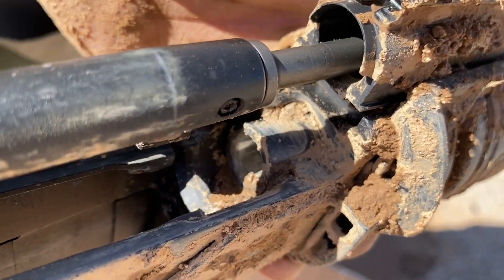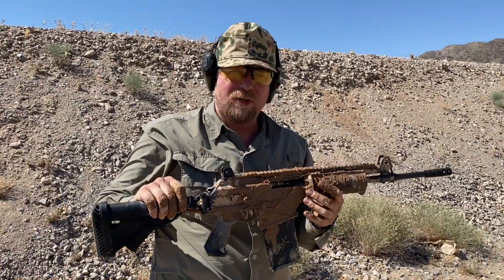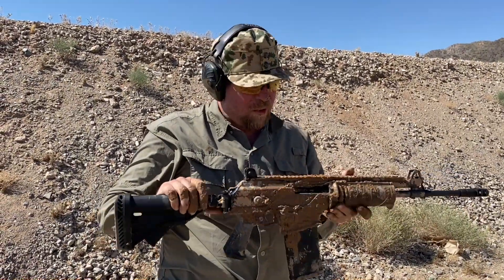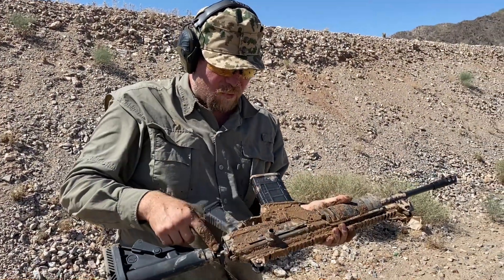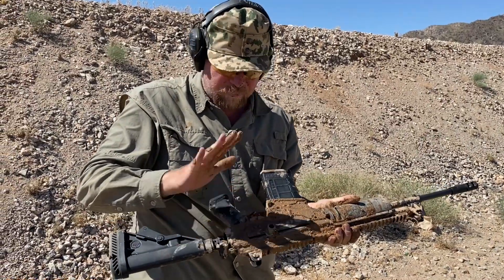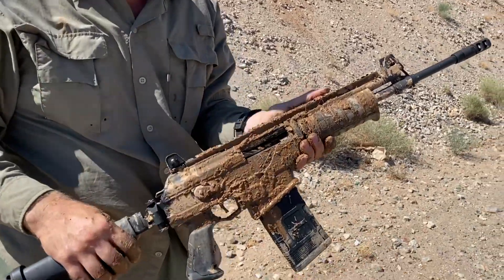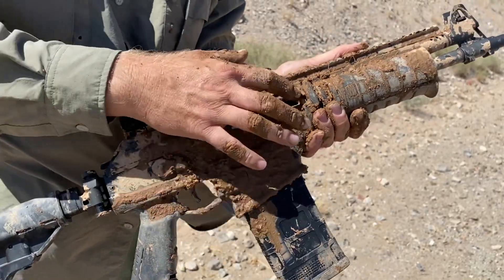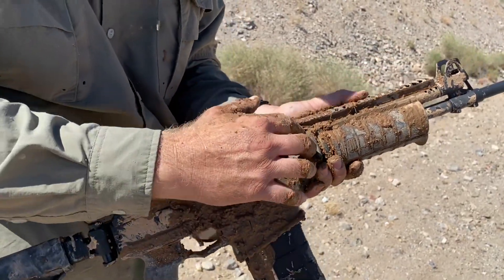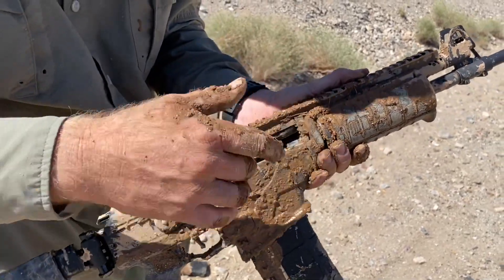So the Galil Ace is better, but the reality is this is going to inherently be a problem with a very large unprotected ejection port. This is better than a traditional AK — a traditional AK fails really quickly. The mud cover on the left side of the gun where the charging handle is absolutely worked perfectly. But the ejection port and bolt reciprocation area — not. That's where everything ingressed in. Maybe something here to deal with the mud and dirt ingress — maybe even a shield, because it seemed like it was falling in from up here above the handguards, right into the action.